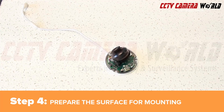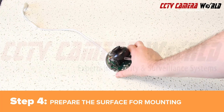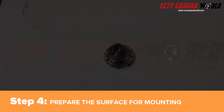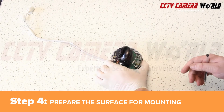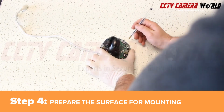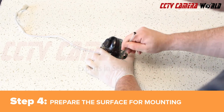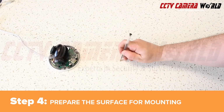Position the camera to face the direction that you want to capture. Once the camera is located over the spot that you would like to mount it, mark the screw holes for drilling. Take note of the pigtail's position coming out of the camera's housing. A larger hole will have to be drilled to feed through the tile.